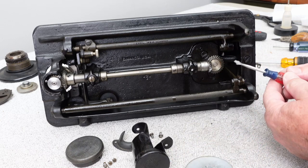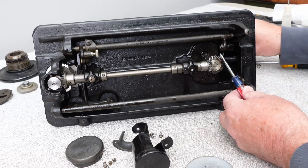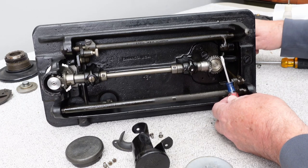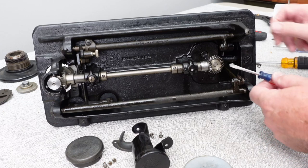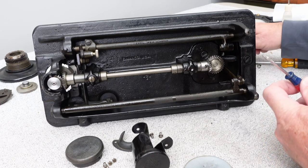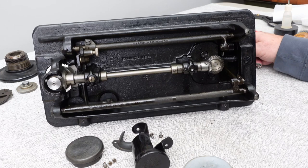And then I can just put a little bit of grease on that gear. It doesn't need a lot. Just enough to help the oil stick so it doesn't fly off when you're running the machine. Now, I know other people might do it a different way, but this is the way I like to do it. And I've got a nice light coating of grease mixed with the oil on there, and that's all it's going to need. So I'm gonna go ahead and do the other side,